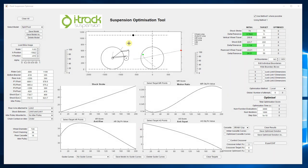So that's enough about split pivot type suspension systems. I was hoping to get horst links into this episode as well, but we're well over 30 minutes already, so that's enough for one episode. Next episode, I'll talk about horst link designs, which are quite similar to split pivots, and I might get on to short link four-bars as well. I hope you enjoyed this one, and feel free to shoot me any questions in the comments. Cheers, bye.